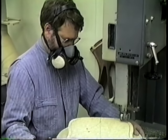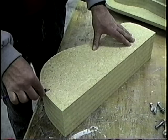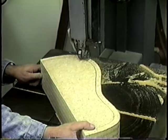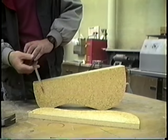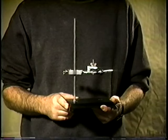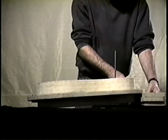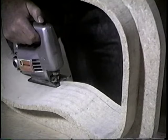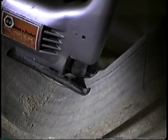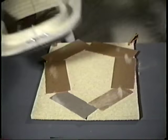A precise cut is essential — the bandsaw table must be square and the blade sharp. We made a cut about one-eighth inch deep on the opposite side of the bracket, used later when trimming the sides. We removed the cutout section, sawed it down the center line, drew about half an inch in, and cut again, separating a single layer. We glued this board and the bending form was finished. To mark the taper of the sound box, we made a tool from clamps with the pen set to the maximum body thickness. A small jigsaw easily cut out the taper. A power sander and long flat board smoothed the form edges.